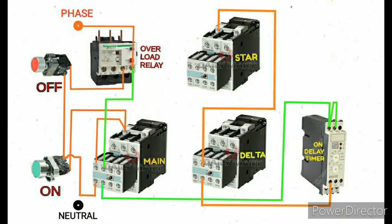This is the main interlock for star-delta. Once the delta contactor picks up, its NC contact comes to NO, so the star contactor is unable to pick up. This is called the interlock connection. Next, I take the timer's auxiliary contact NO, then give it to the star contactor auxiliary contact NC, same as the delta contactor NC.